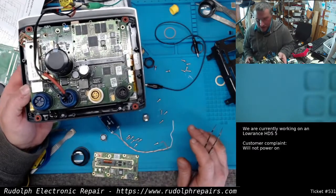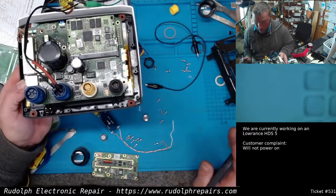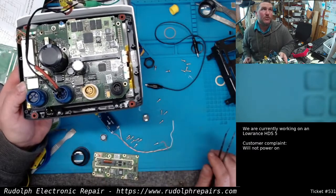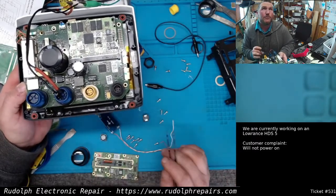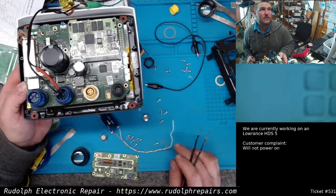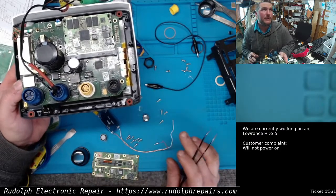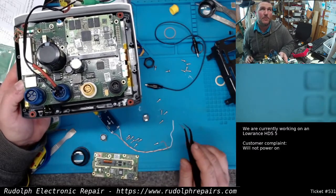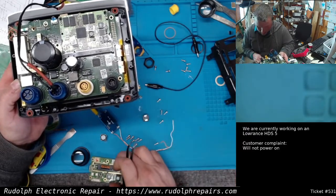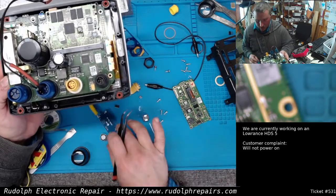At this point I'm thinking maybe this chip is bad or this other chip is bad, and I don't have a spare. My idea was: I'm going to strip this side of the board, make my own 5 volts, inject my own 5 volts into that processor, and just bypass all the failures. Don't even take the time to figure out where those failures are, because I'm already eating up a bunch of time and there could be components we can't source.